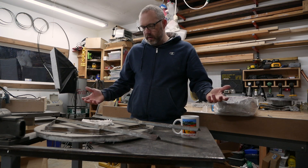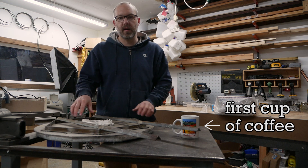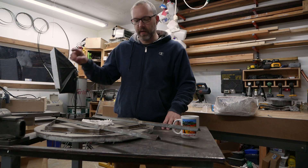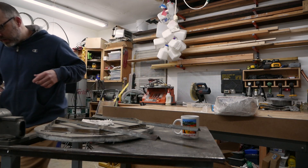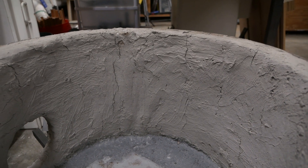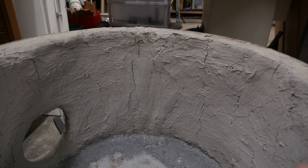So what's left to do? Not much, actually. I just have to finish putting Satanite on the lid. If you remember a long time back, I put Satanite on the Kaowool on the bottom drum. Let's take a look at it. So it's had plenty of time to dry. It has been heated up a little bit — certainly not to furnace temperatures, a couple hundred degrees anyway.